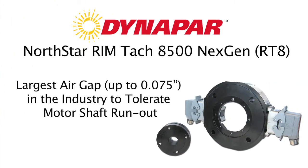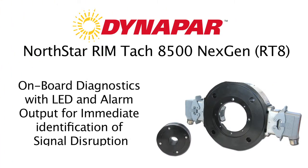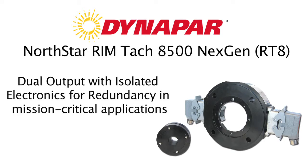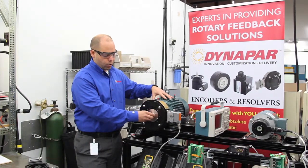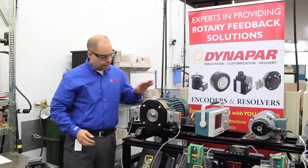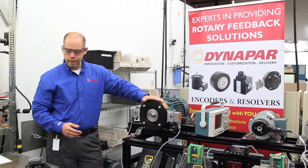What we'll talk about here on the RT8 is the fact that it is bearingless. The big advantage of a bearingless encoder is the fact that there are no bearings — it's one less item to fail in the encoder, so there are no wear points to cause a problem. In a bearingless encoder, we typically use the motor's bearings to hold the alignment between the rotating piece, which we call the pulse wheel, and the sensor modules. This is one of the larger units, the RT8, which is used on an 8.5 inch C-face motor frame.